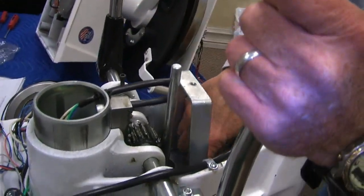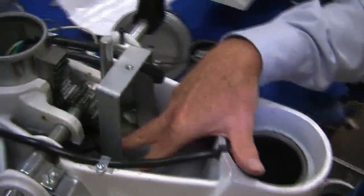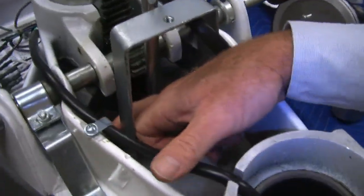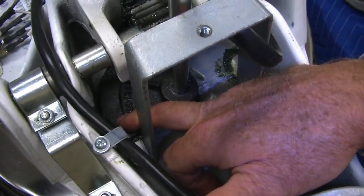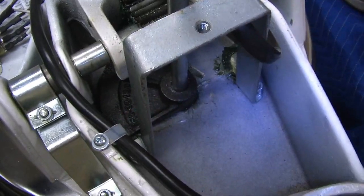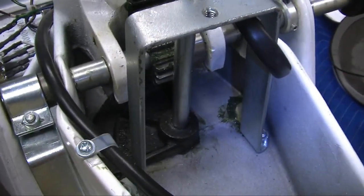This right here, if I could turn it, right, if you look in here, there's the cam ramp. This sits thin on this side, and the cam ramp's contour goes up when you want to do thick, so it changes the opposite side of this, which is where it strikes, so it changes the thickness for you.